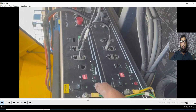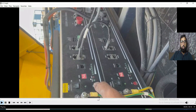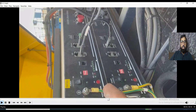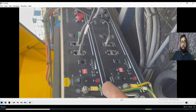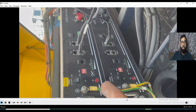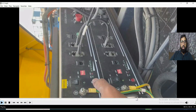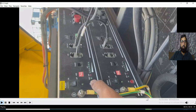As you can see, no LED is getting on — even the alarm LED is off. So here we have two types of scenarios. First: if all LEDs are off, what can be the solution? Second: if LEDs are on but the alarm LED is on with buzzer beep, what can be the solution? Third: if all LEDs are on but the inverter is still not charging because they are not communicating — this is one of the communication cables with the inverter.